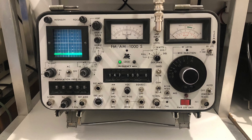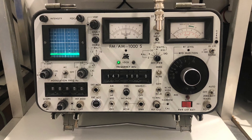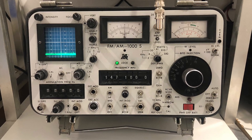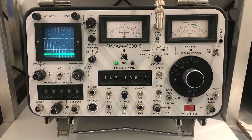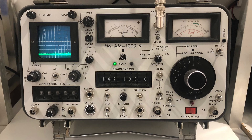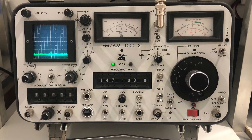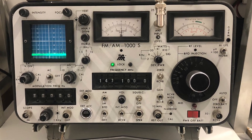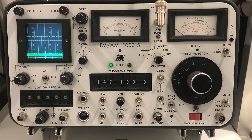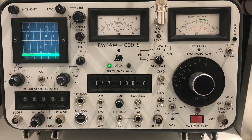One of the attractions of these units is that they're still easily repairable. The blue fiberglass PC boards in some early IFRs can be fragile and you've got to be careful soldering them, but unlike some of the other test sets around, there's very little unobtainium in these things. No programmable gate arrays, no firmware in volatile memory, no esoteric semiconductors — just easily obtained 74-series TTL or 74LS, 4000-series CMOS, and transistors like 2N2222s. All very straightforward stuff.